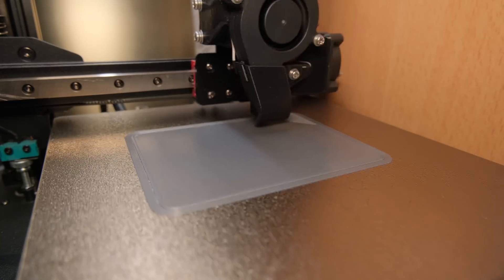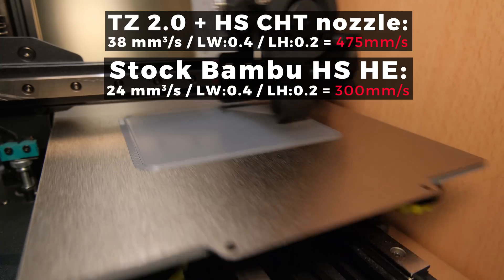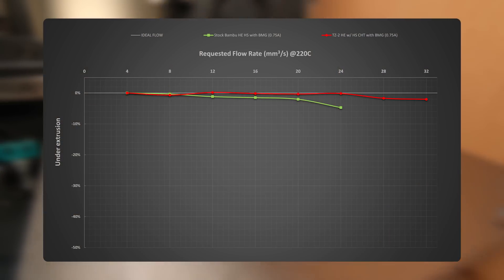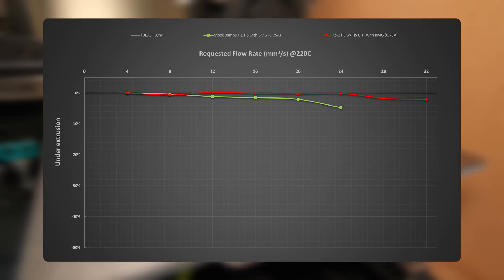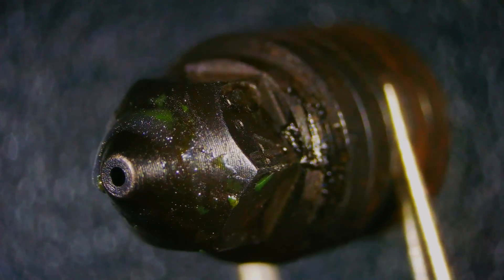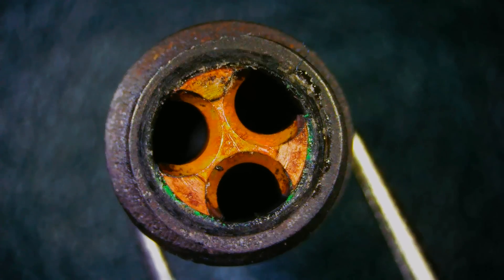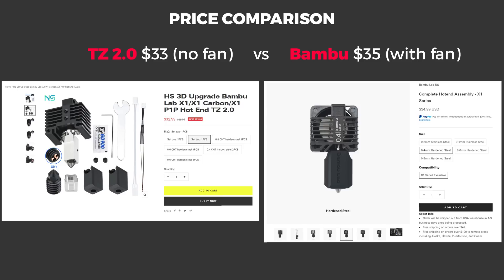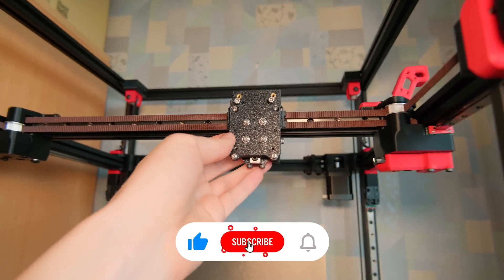Being able to make a drop-in replacement and print up to 475 mm per second compared to 300 mm per second at regular settings is a huge boost. If you value print quality and layer adhesion most, having a hotend that performs without any under-extrusion at 24 mm³ per second — compared to the stock Bambu which starts to drop off even from 8 mm³ per second — gives the ability to print so much faster while still properly heating the filament and not sacrificing adhesion. The only hard question is longevity: the soft copper insert will wear out faster if all you print is abrasive filaments, but for the majority who only occasionally print abrasives, durability will be more than enough. Plus the price is very competitive even compared to the stock Bambu hotend. This one will likely be going into my Voron 2.4 that I am building behind the scenes, so make sure to subscribe for that printer testing video.